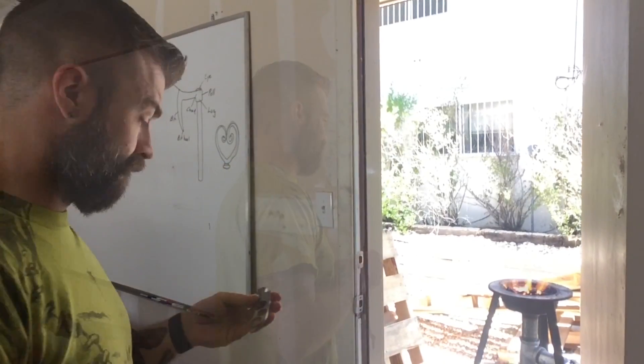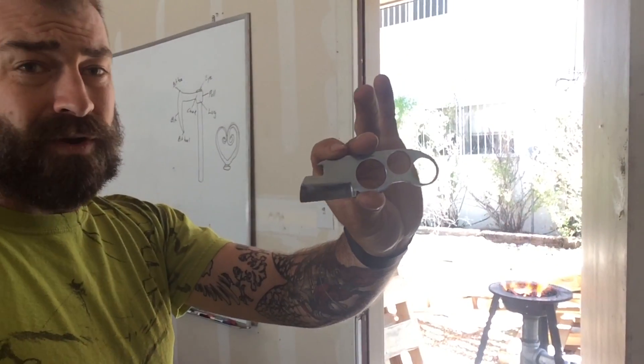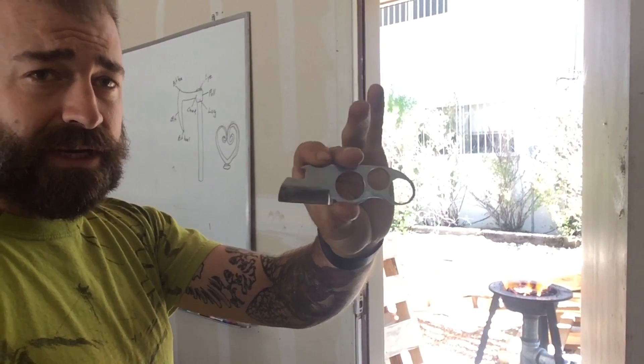Today's victim is going to be the M-Tuck. I made a cool blade out of 1080 steel, but until it gets treated, it's junk. I tried sharpening it — it just didn't keep its edge because it's so soft still. It definitely needs to be treated, so I'm going to throw this almost completed project into the forge, and this is the one we're going to be heat treating today. With the paracord wrap off of it, it's ready to go into the forge.